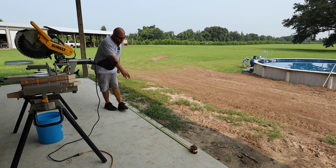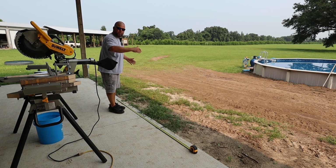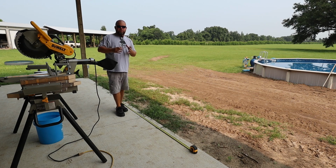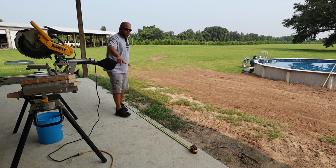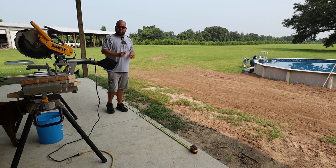So now what we can do, we can measure off that reference line. I know that I want our deck opening, we're gonna do 8 foot from outside of post to outside of post here. And I chose 8 foot specifically because of the type of decking material going with, a very expensive composite. I don't really want much waste at all. And you can get 16-foot and 20-foot composite boards, I should say, not lumber, for this particular company that we've ordered from. So I know I can take my 16-footers, cut them in half, and we're gonna have a minor little bit of trim on either side because we're gonna picture frame and border this composite decking out. This will make sense in the next episode.